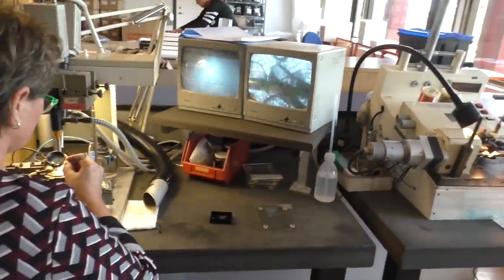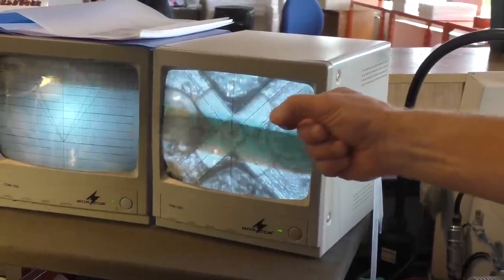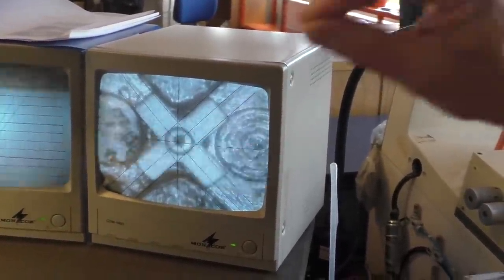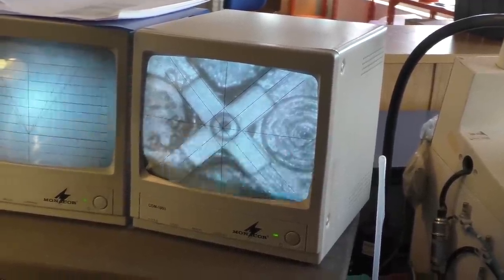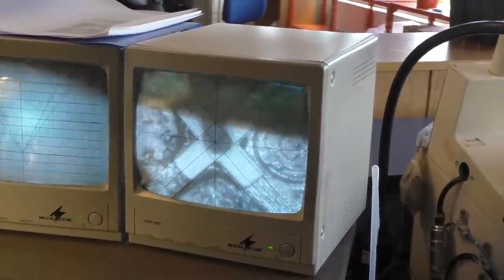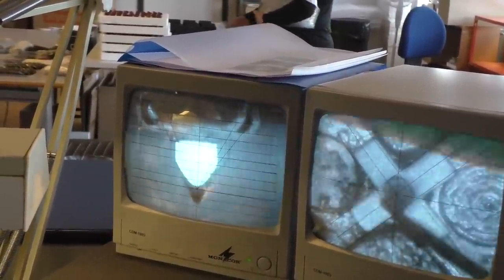Well, we will have the cantilever mounted on the armature. So this is the armature with a small tube sticking up, which has been riveted to the armature. So this is, of course, an iron armature, and you have a rivet made out of aluminum. And now we will put the cantilever on. It's a little bit of glue. And then you can see on the other screen over here how to align it. So of course the stylus needs to be aligned with respect to the cross armature.